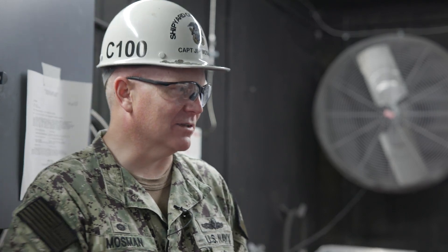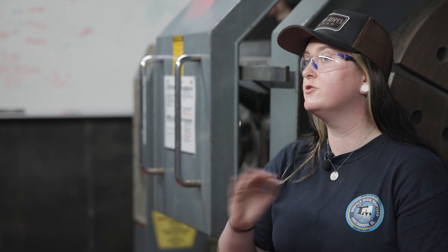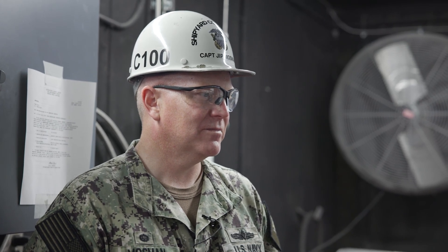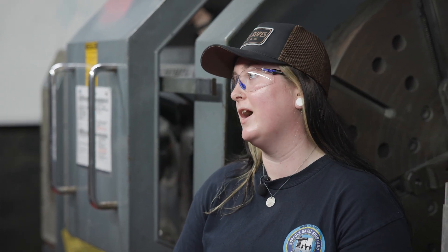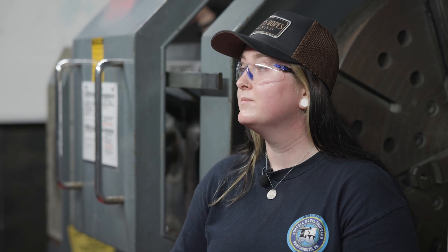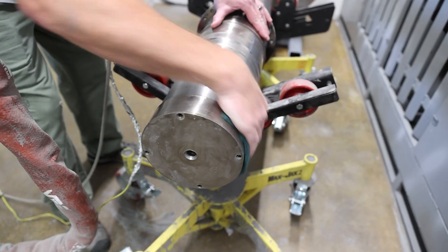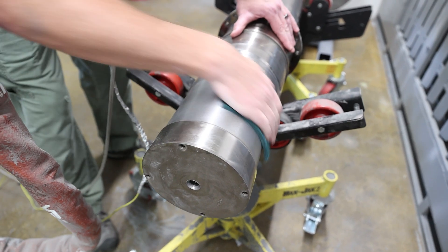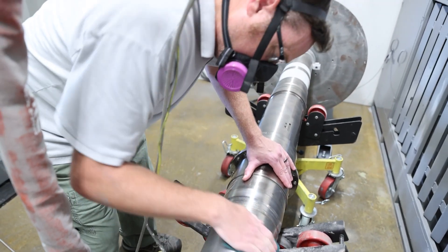When you say adhesion rate, how do you tell how well it's adhering? Usually we do about five passes over the tensile bars — that's where we run into this issue. You'll do about five passes, measure your substrate before and after the spray, then divide it by how many passes you did. That gives you a pretty good estimate of how much you're throwing down per pass. You put down more than you need — anywhere from 15 to 20 thou oversize is usually what you want to shoot for.